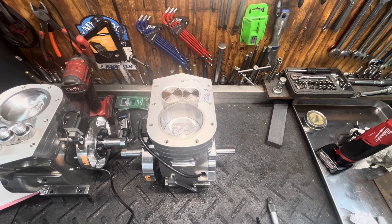The reason why is these pistons are tapered, and after you run them and they get 60, 70, 80 runs on them, the pistons start to shrink. So your measurement of the piston is not going to be accurate. So if you have a motor and you need a new piston, either use the part number on the old piston.